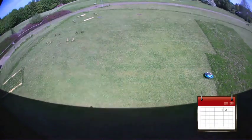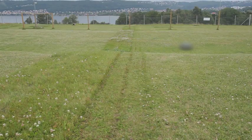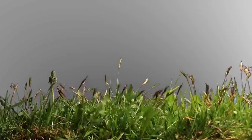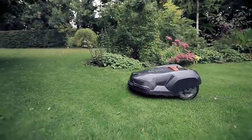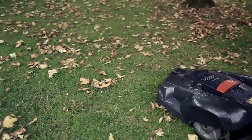By testing for a period of at least 4 weeks, it is possible to detect unwanted repetitive behavior of the mower that causes wear and tracks on the lawn. When grass gets plenty of water it starts to grow fast, and because it can be rainy weather for weeks, a robotic lawnmower needs to be able to operate also in rain. In a long-term test period of one month, all weather conditions will normally be covered. Basically, let the mower operate at maximum specified area, in different weather conditions, during a minimum period of one month — then supervise and evaluate.